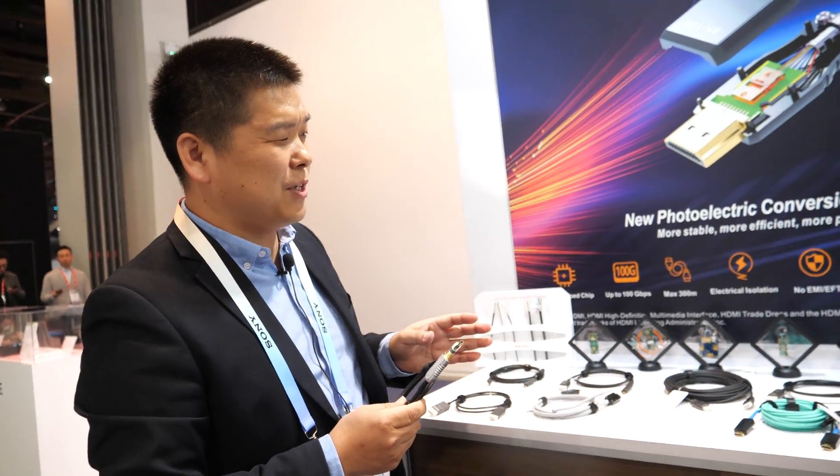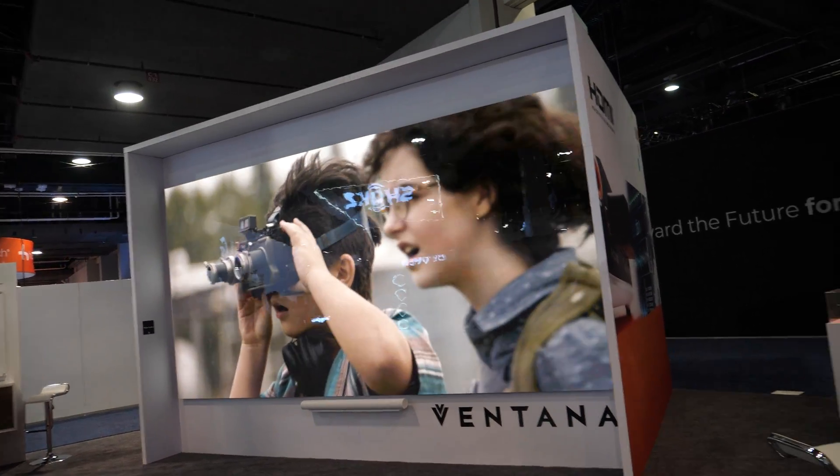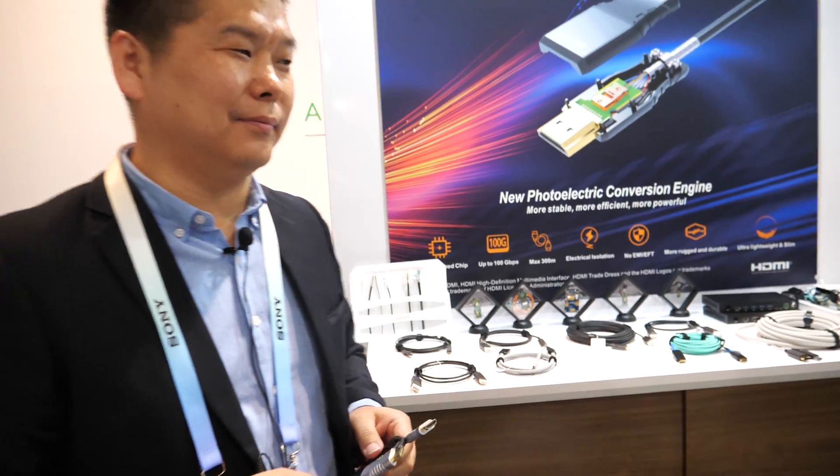So you're ready for the next generation HDMI? Yes, because the current HDMI 2.1 is 48 gigabits — we will double it. The technology is from data centers so it's easy to achieve 100 gigabits. This is for special projects — maybe someone wants to do 8K at 120Hz uncompressed, or drive a very big screen, like the Sphere. The next step for HDMI is doubling the refresh rate, so very high bandwidth is needed.